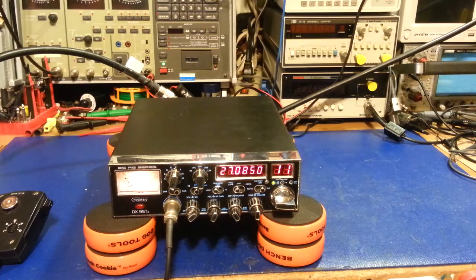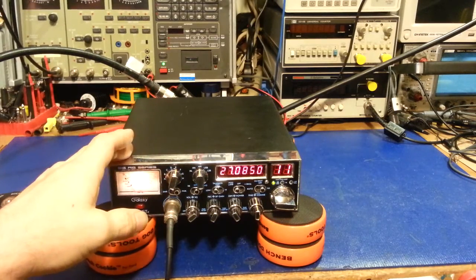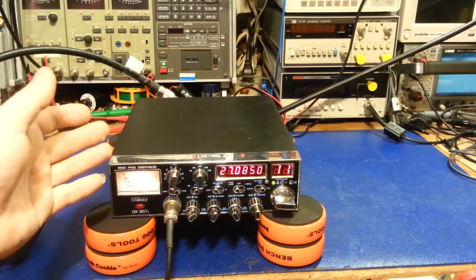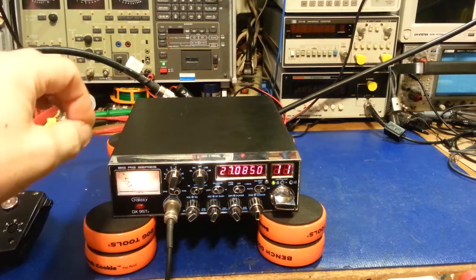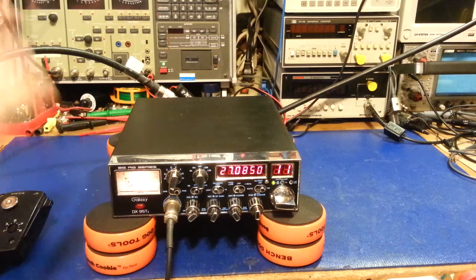It does have a small 54 megahertz spike, which is expected after going through a two-transistor amplifier. But the IMD products — oh my god. It's not a second harmonic, it's third-order IMD products, and they're not coming from inside the radio itself. I did some sniffing around internally and the output at the input of the amplifier circuit looks fine. After the amplifier, which has a cover on the inside, I could see the loctite was broken loose on the screw heads, so I took the cover off — the amplifier circuit did not look like it had ever been tinkered with.